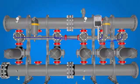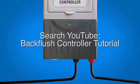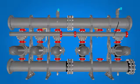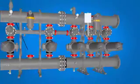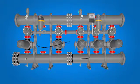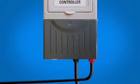Bring the controller wires from each solenoid to the controller. Refer to the controller instructions or the YouTube video NetFM Backflush Controller. Connect the 8mm tubing from the manifolds to the controller — the top manifold tubes to the red inlet and the bottom manifold tubes to the black inlet on the controller.